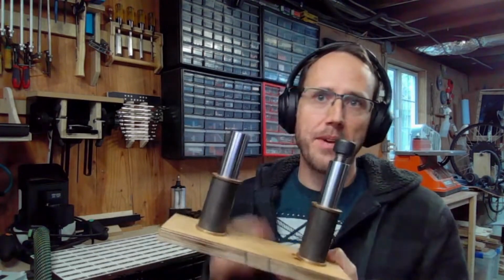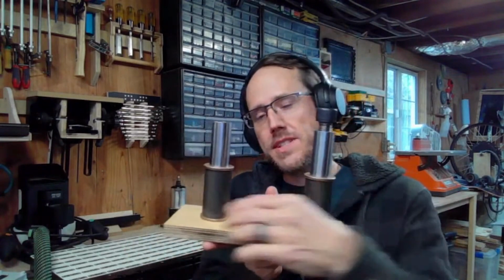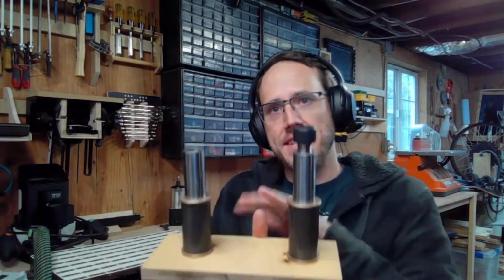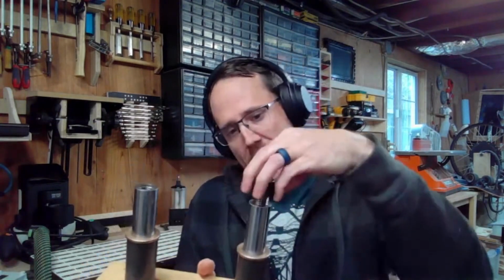So this was a project a buddy of mine, Josh from Rapid Whale, was designing a mountain unicycle with suspension. So he asked me to come up with a weld fixture to locate these two sliding bearings 6 inches apart with fair accuracy and also nice and straight and parallel. And so, I have some tools at my disposal. I have access to Origin. I have access to nice gauging and marking stuff, drill press, hand tools, even a little milling machine.